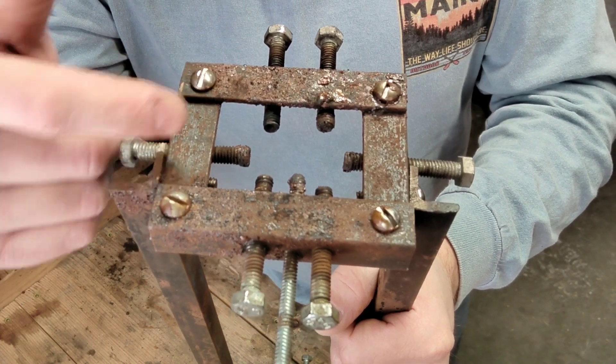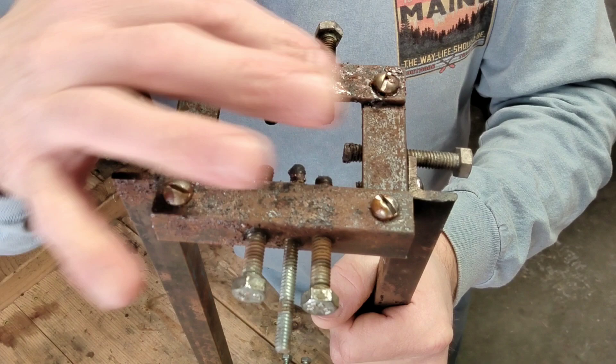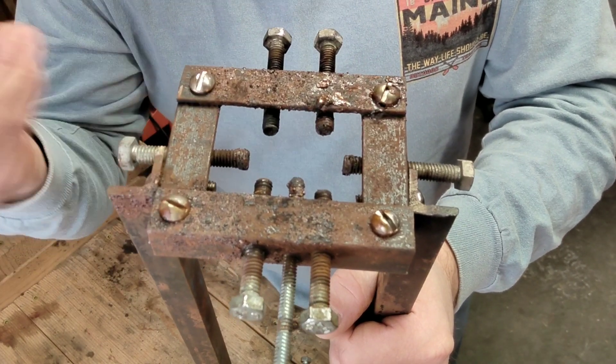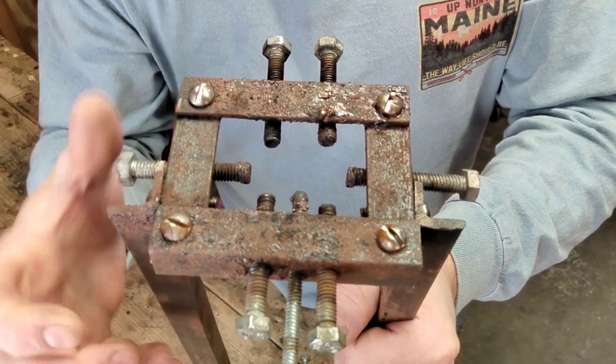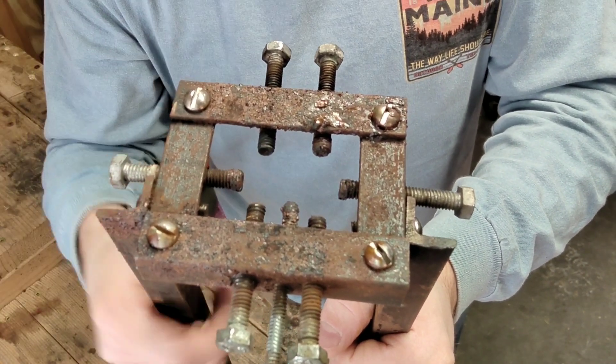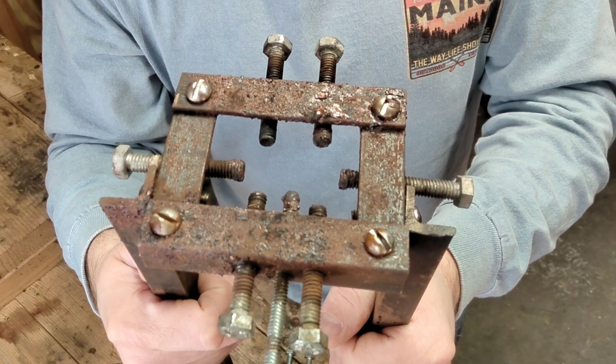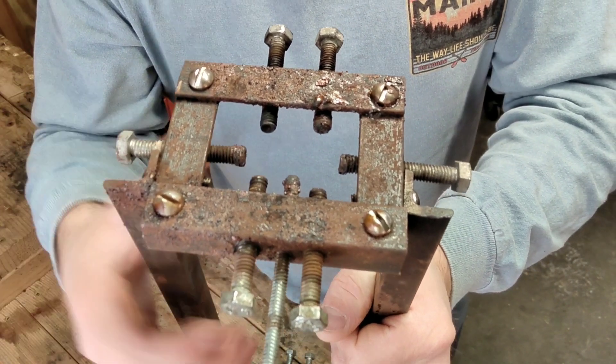These are all held together right here with just screws. I tapped the back one right here, tighten those up, and then I just soldered them — they will not move. If you want, you can have someone weld them; if you have a welder at home you could weld one of these together. I don't have a welder, so I brazed or soldered, and it works great.